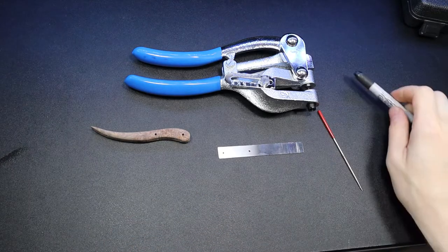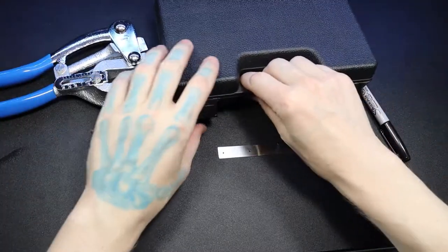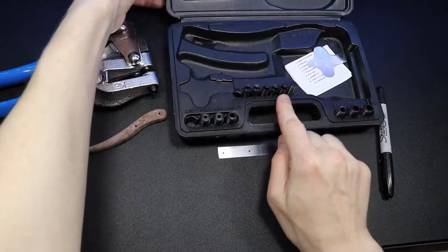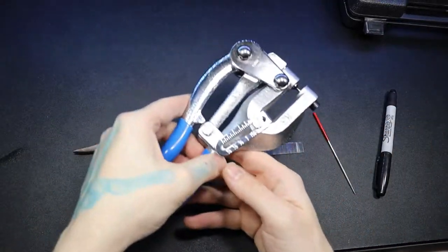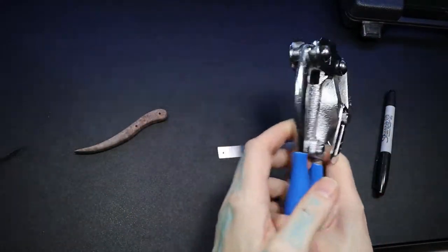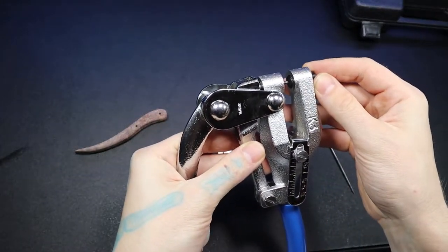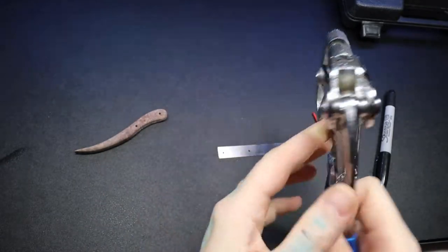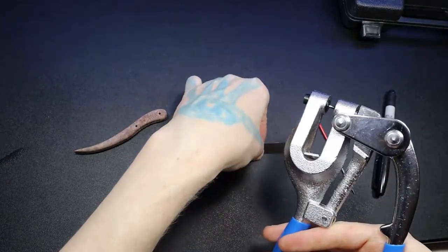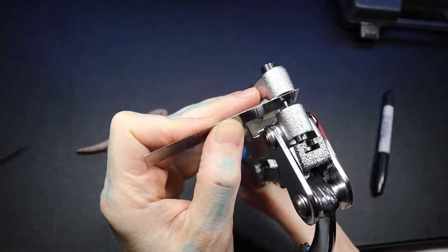What I use is a metal punch — this pack comes with a whole bunch of different sizes for punching holes. It's totally worth it; it's cheap and saves so much time. If you don't have one, use a drill with a good drill bit, and always use drill lube — it makes a big difference. Line up your holes with the punch.